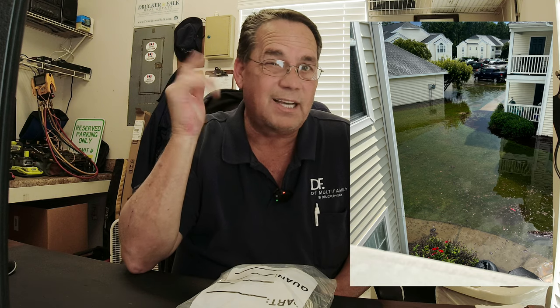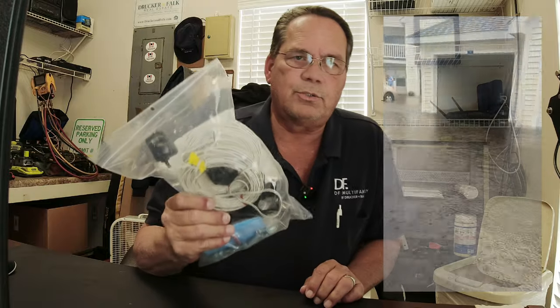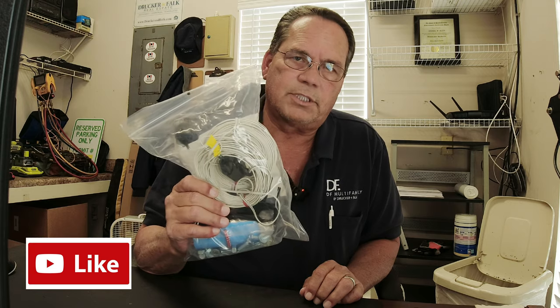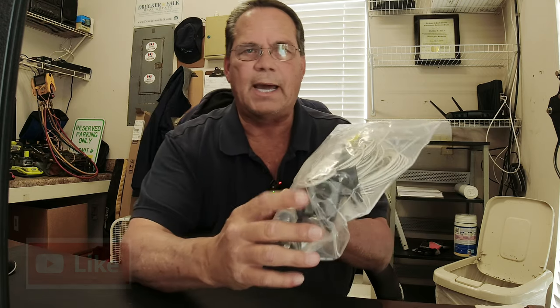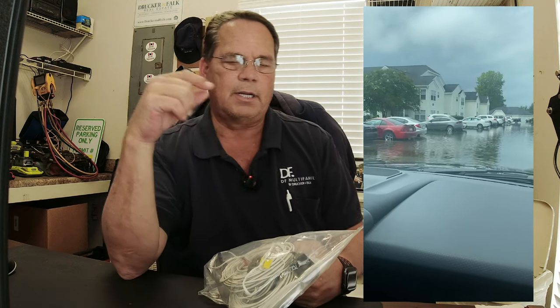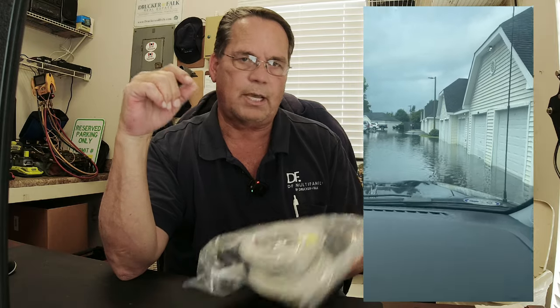Man, I'm going to tell you what. The other day we had one heck of a rainstorm. It was so bad and it was flooding so bad around here on my driveways. Here, I'll show you some pictures right here. We took out probably about a dozen garage door sensors. I went to the local overhead door and picked up a dozen door sensor packs. It comes with the brackets, comes with the sensors, and you can see what we got going on here and how these things got flooded out. These sensors get wet, water gets in the electronics of them and burns them out.